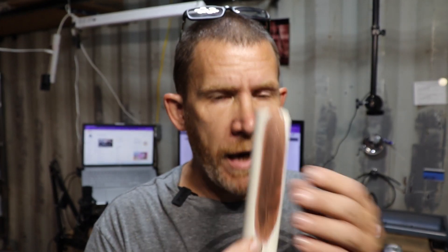I had also done a test earlier — a speed/power test — with dry moly, and then with Heirloom White spray paint two coats, to see if that would do it, because it works on white tile. It did absolutely nothing. But when I went back and looked at that piece, after cleaning it off with lacquer thinner, there's zero hazing. That tells me that the dry moly is actually etching the copper and causing the haze. I even took a 1500 PSI pressure washer to it to see if that would knock the dry moly off without chemicals — no, it doesn't work. The dry moly stays on and the copper was still etched.